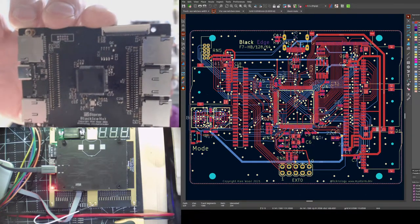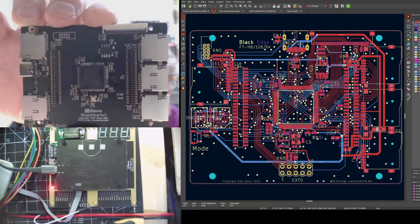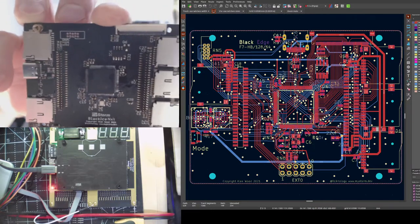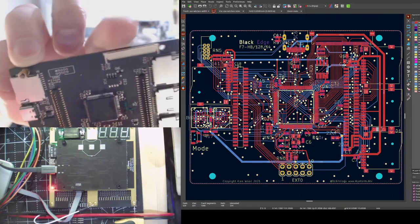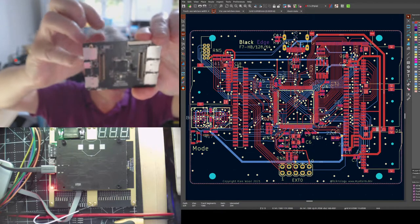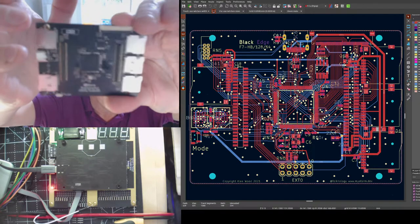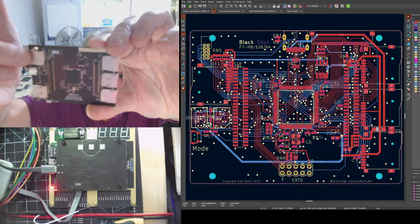So if you look at the diagram now on your right-hand side, you'll notice it's slightly different. We've still got the three blades on the right-hand side. I know it's inverted in the camera, but we've lost this blade here. And the USB that was there is now up here next to this FPC connector. The SD card connector has moved down, and I don't know if you can see it here, but the debug connector is now moved over to here.